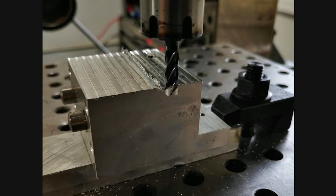There is no squealing, but the cutter loaded up in a hurry. This can usually be avoided with proper lubrication, so I improperly lubricated by painting the surface with oil, the way you might do on a lathe. I then ran tests at 15, 30, and 70 mil cutting depth and I'm generally pleased with the outcome.